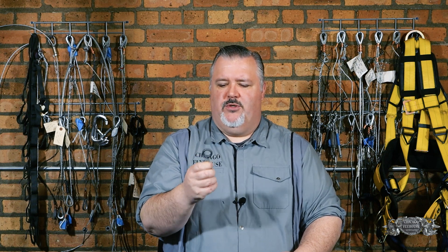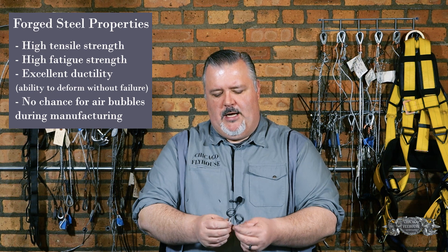This one is a non-shouldered forged steel eye bolt. The difference is that the bent wire is basically drawn through a mold that makes the wire, then it's folded and bent and it stays bent. With a forged eye bolt, you'll notice it's a complete circle because it was solid steel the whole time it was being made. It was heated — just think of a blacksmith in a forge. They hammer on things to smack it into shape, and that's what's done to make these. They're essentially hammered into shape but stay solid material the whole time. What that means is the molecular structure stays as a solid, and so when it cools down, assuming it's done correctly, we get a metal piece of hardware that has very much the properties we want to see. We say forged eye bolts because they're a better material choice for the kind of forces we tend to put on things.